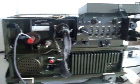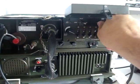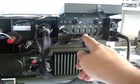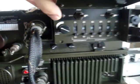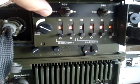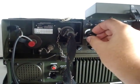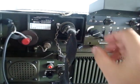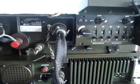The radio is capable of lower sideband, upper sideband, and AM. It tunes from 2 to 30 MHz in 100 Hz steps by means of these switches. The indicator is backlit in case you have to operate it in the dark. There is an independent volume control for the handset, which is on the radio itself. If I turn that to the 600 ohm position, I have fast AGC for data modes.